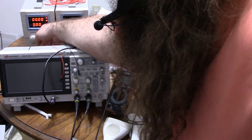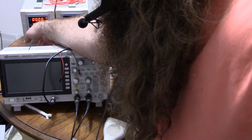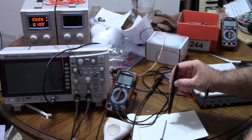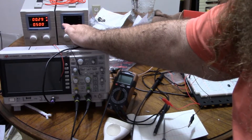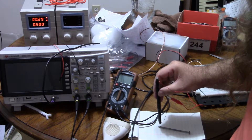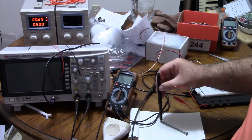Let's try 10 milliamps — still nothing happening. And I'd like to point out this is a heavy nail, relatively speaking — it's a nice masonry nail, so it's going to take some power. So let's go up to 100 milliamps. Now we can actually see the voltage — it's taking approximately 0.06 volts, so 60 millivolts to give us 100 milliamps. You can see there's no resistance. Still nothing, but nothing's heating up — everything's good. So let's do half an amp. Half an amp, only 290-ish millivolts. Does half an amp do anything? It does, but it's not strong. If I do the tip right here, you can see it starts to lift just barely — comes up a teeny tiny bit and then puts it back down because it's just not strong enough.